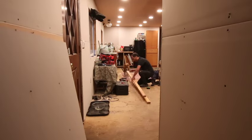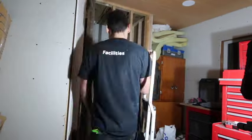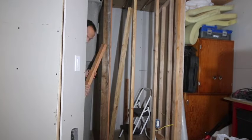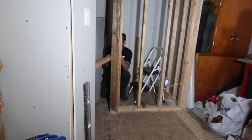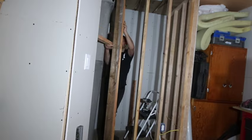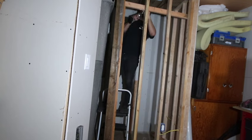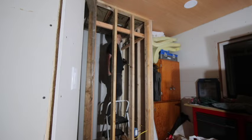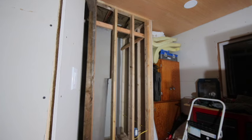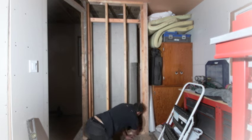Howdy y'all. On this one we're working on the shower stalls in the front bathroom — it's not anchored down so we're just finishing that up to get it anchored in. When I originally made this little cubby I put drywall in on those two walls, only because that's how it was when I took the last shower stall out. We took those sheets out and it left a little too much room, but it was actually perfect because I just needed to put in a two-by-four thickness-wise and the shower slides in and fits perfectly. We're putting little braces around the top so I'll have something to screw the shower into.